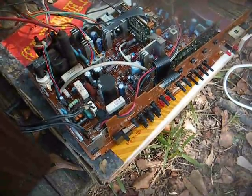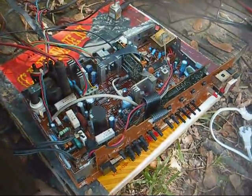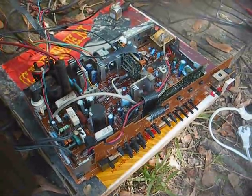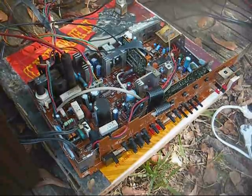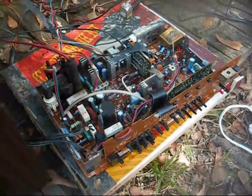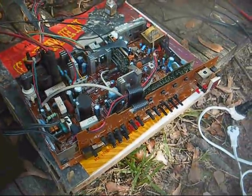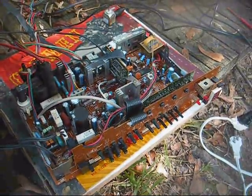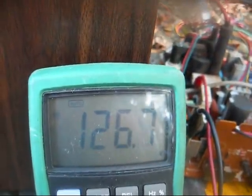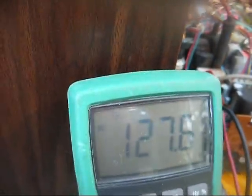So I got online to look for a free service manual for this TV, which is a model ECR2100D, and of course everything I found was these sites wanting me to pay for a service manual, and I'm not paying for a service manual on a junker TV that I'm probably going to end up just giving away anyhow. So I did some more looking, and I found a power supply schematic for an ECR1350, which is the 13-inch version that uses this same basic chassis, and the B+ for that set is 127 volts. So if my memory serves me correctly, the B+ for the 13 and 19 were the same, so we'll just adjust this for 127 volts and see how it goes. All right, 127, let's turn the brightness and contrast down, and it should remain within spec, and it does, and that's good.